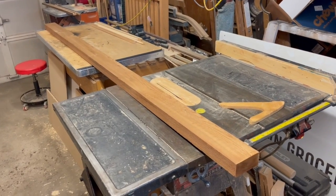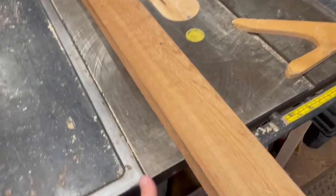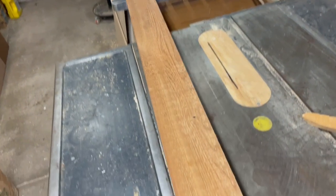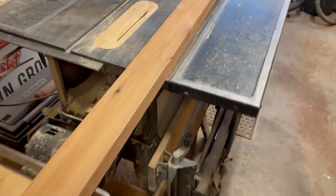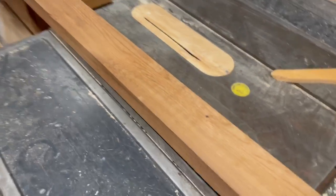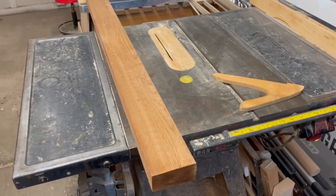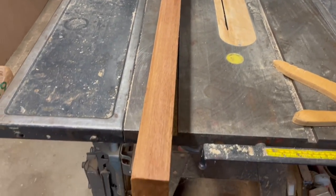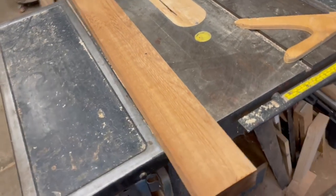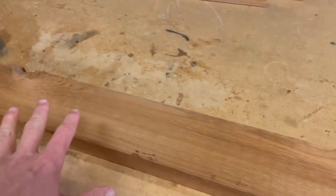What I have here is a piece of rough-cut cedar dimensional lumber — it's rough-cut like a two-by-four basically, but not like what you'd expect to find on a stud. This is fencing material, essentially like cross-beam fencing material. The grain on this particular piece is really straight, and I'm shooting for the straightest possible grain I can get end to end, almost as if we were making a bow out of it, so it runs all the way along the shaft from end to end, which makes it really sturdy.